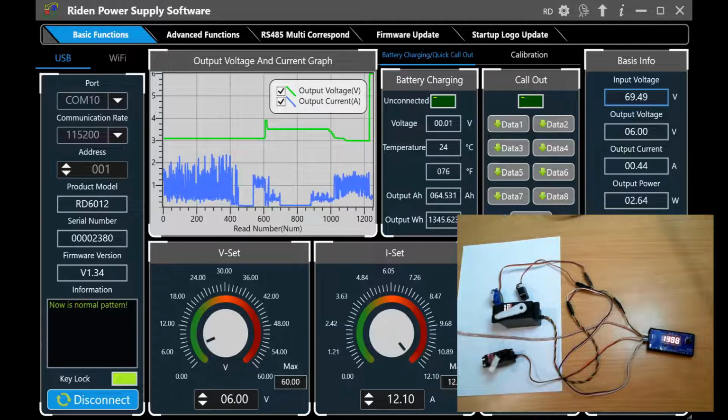You can also see on the graph what's been going on with the current draw. Now with proper voltage supply, they're all working, they're all running their full path. And look at how much the current draw on the power supply has dropped off. And that current draw is actually going to make voltage drop issues in your wiring much more of an issue.